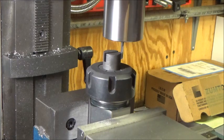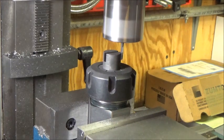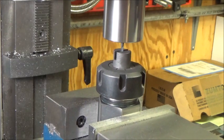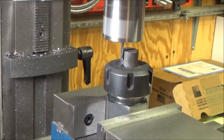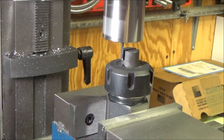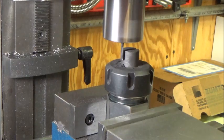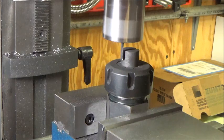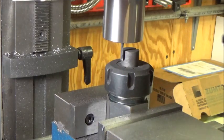So what we're going to do now is finish cutting the slot, then flop it over in the vise and drill it and tap it. We'll drill a hole straight through at the small tap size, and then drill an eighth-inch hole halfway through, which is the size of the wrist pin for the push rod. This piston would probably be better if it were hollow and set up differently, but that's not the way my push rod is currently set up. So I'm just going to replicate the exact duplicate of the current aluminum piston.